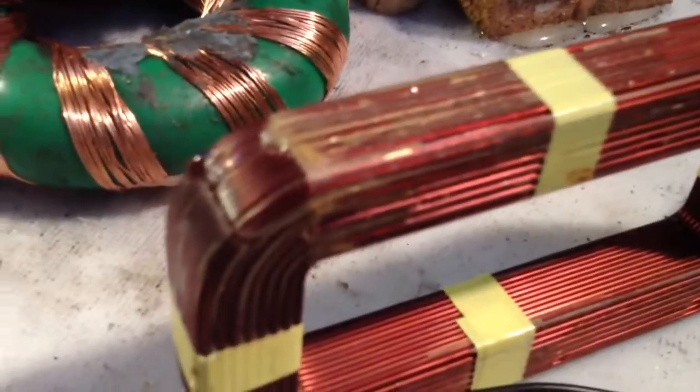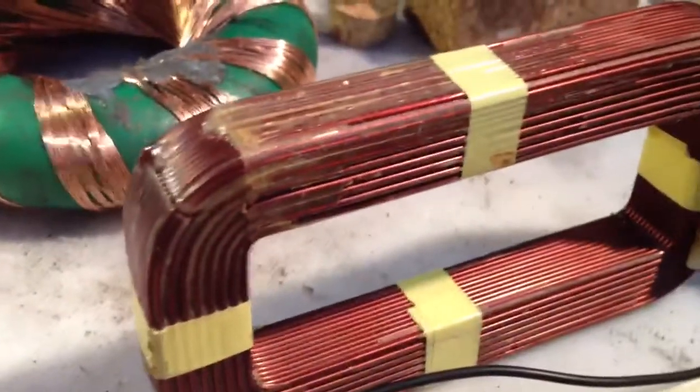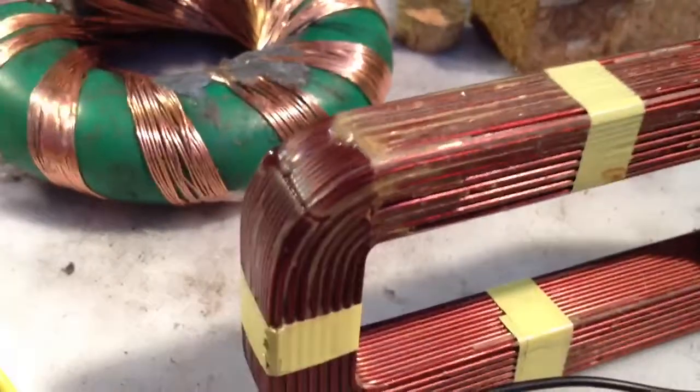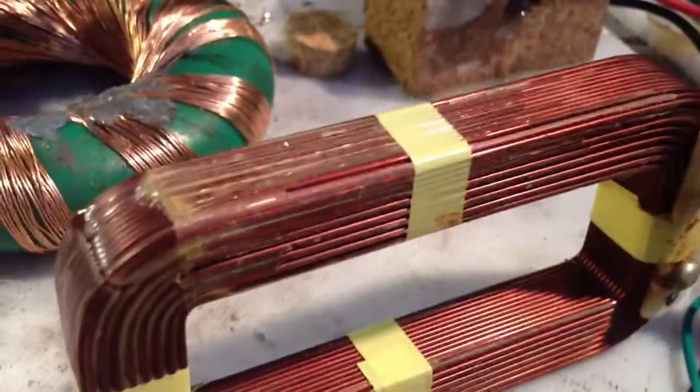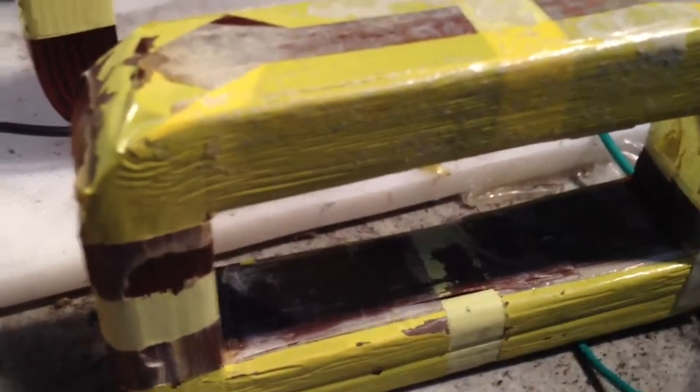Same little circuit as before. I'm using this microwave oven transformer coil as the trigger coil, so rather than using a Hall Effect Switch, I'm using that. That's just hooked up to the base of the transistor on the circuit. And I'm using the other side of the microwave oven transformer coil as the generator coil to pick up, and I've just got that hooked up to a bridge rectifier. This is the much higher impedance coil, as you can tell.